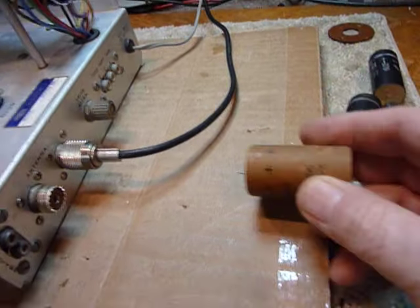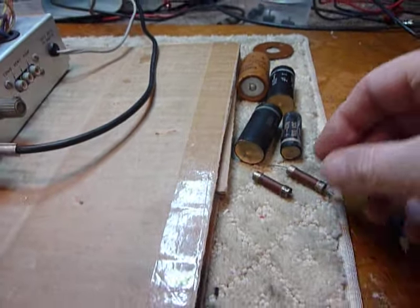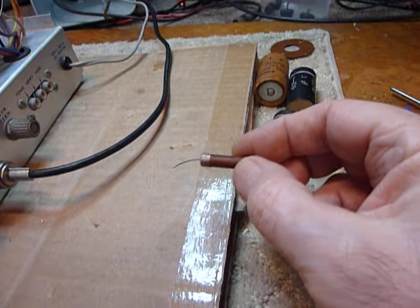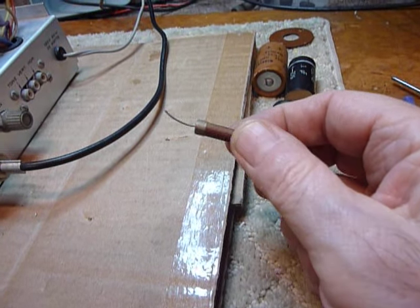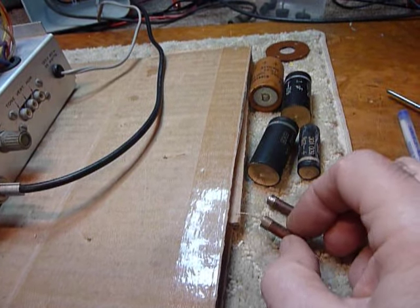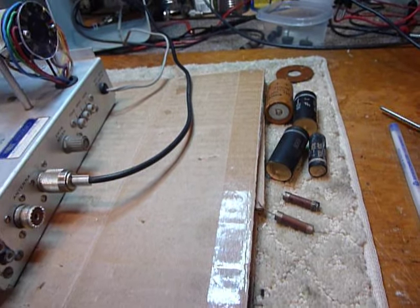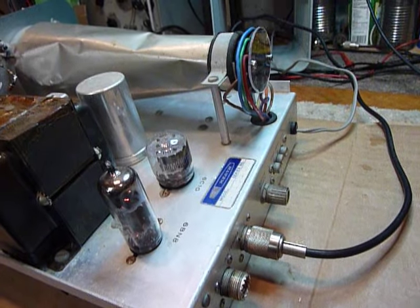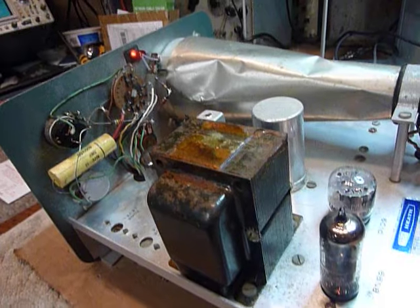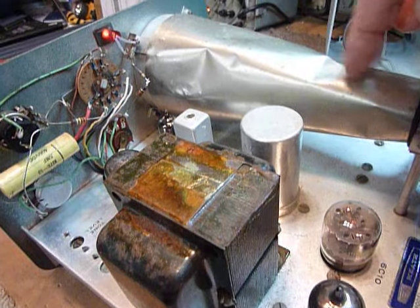While I had this out, I also did some other changes — I changed the 40 microfarad capacitor and a couple of 0.1s, and I took the selenium rectifiers out and replaced them with 1KV silicon rectifiers in series for each one, which I encased in heat shrink tubing. That worked out really nicely — it increased the high voltage by about 200 volts because it was sagging a little bit.